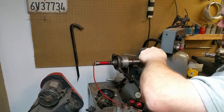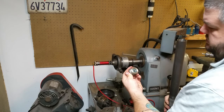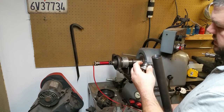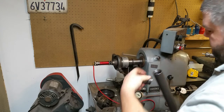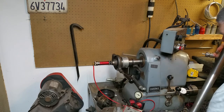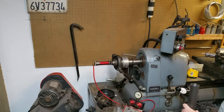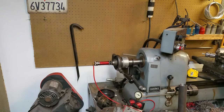I made my own rotary union here out of some skateboard bearings and a quick-connect fitting. This is a rotary union made out of a couple of skateboard bearings, a couple of quad seals, and the quad seal right here actually seals down inside the bore. The bore was honed — I'm not sure if it was a dingle-ball hone or just a regular hone that you'd use for brake cylinders.